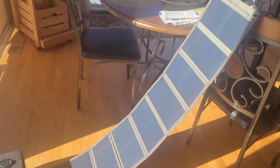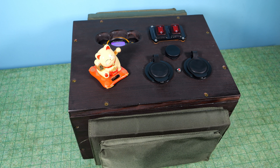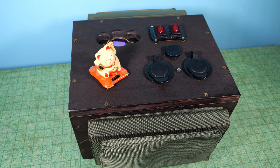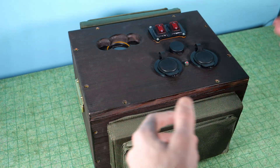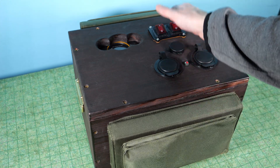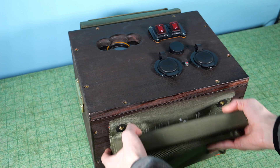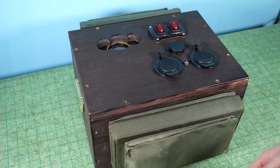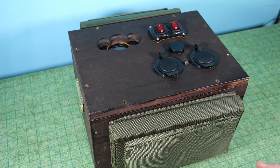I also tested using just one solar panel behind a window and got around 1.1 amps, which is not bad at all. I also tested the system by running it for around five hours straight — charging a tablet, running a small light bulb, and running one of my studio LED lights — and it never overheated, only reaching 86 degrees Fahrenheit. I've been wanting to make a project like this for a long time. I love the idea of using the sun to charge things and run items, and this all-in-one unit with inverter, plugs, outlets, switches, controller, and solar panels is exactly that — a cool little project I've been wanting to do. Thanks for stopping by, and I'll catch you all in the next one.